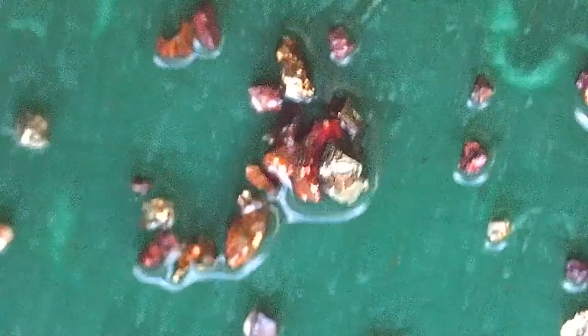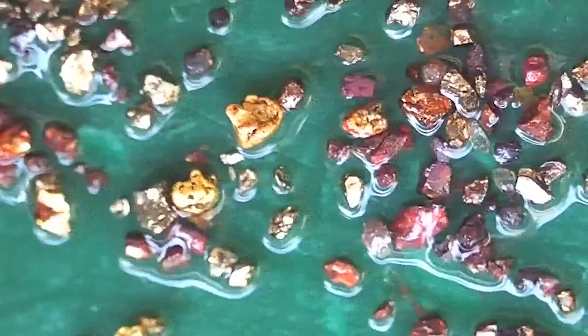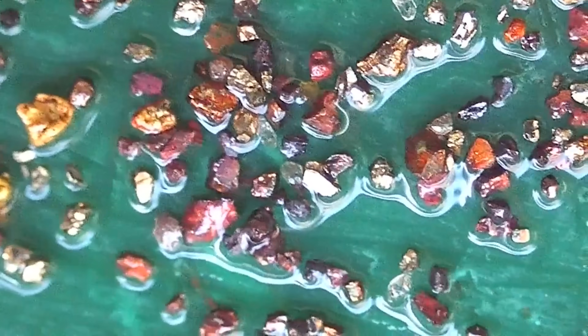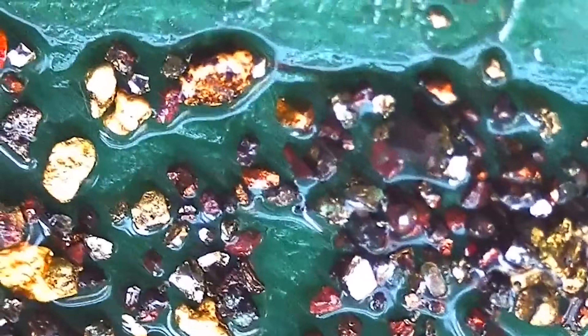I could have roasted it a little bit longer — you're supposed to roast for about a half hour, but I was pretty quick about it, which is why I still have some sulfides in the mix. You can see where some of the gold is transitioning out of the sulfides, and there are also some larger pieces floating around too. There are still a whole bunch of sulfides that need to be roasted out, along with crystal structures and pieces of iron hematite. So I would recommend roasting for at least a half hour, constantly stirring so you oxygenate it and get the sulfur to burn off.